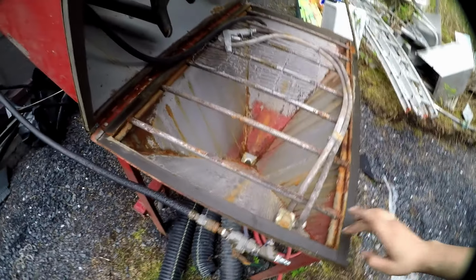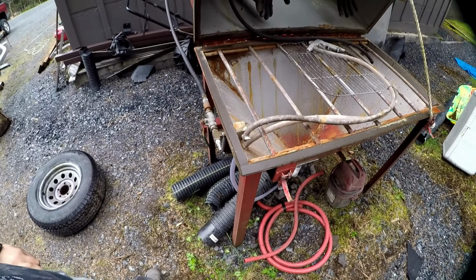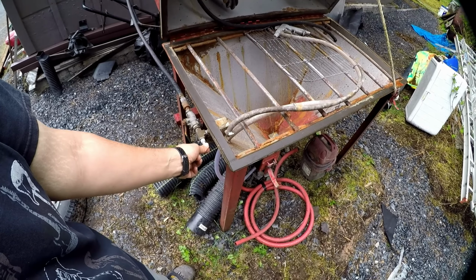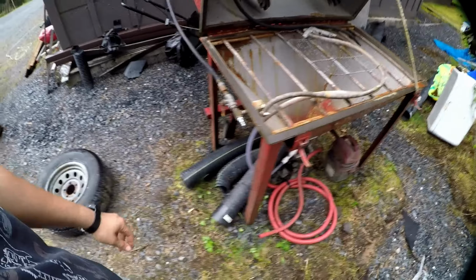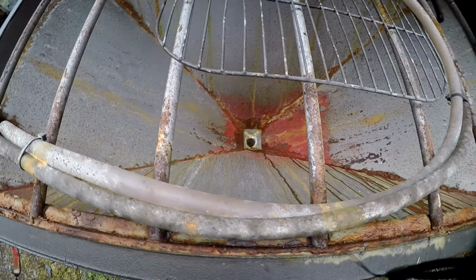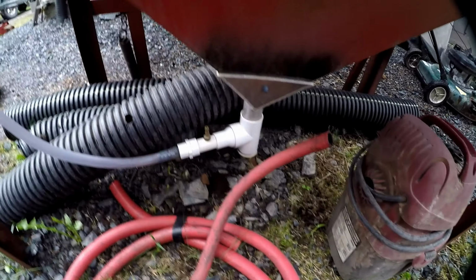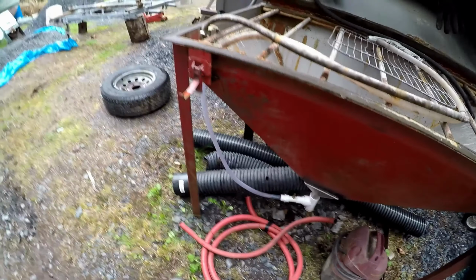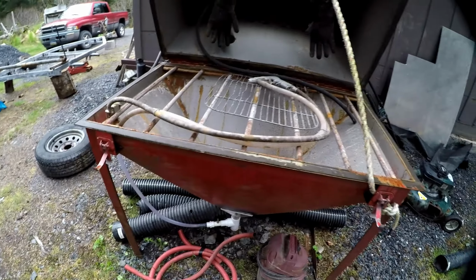Alright, well, it's a little soggy. Alright, so this is our sandblaster here. So we connect compressed air to right here, and then down the hopper here, inside, we just pour the blasting media. Down there is a sort of suction line, and the compressed air just creates a vacuum and makes it suck up through the hose and blast out of that nozzle there.